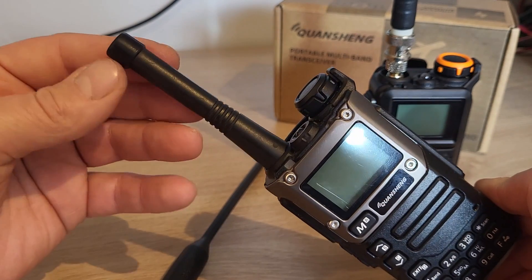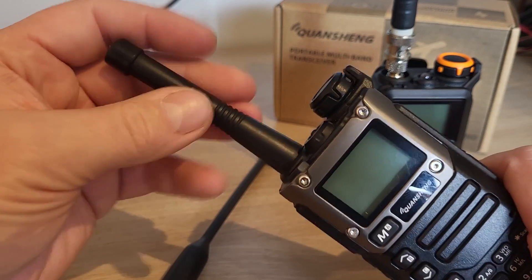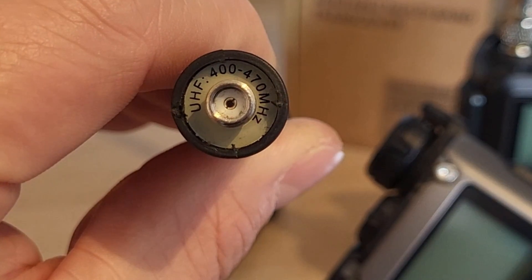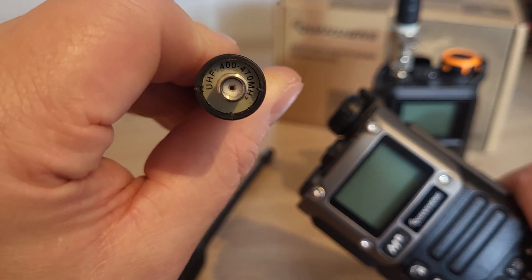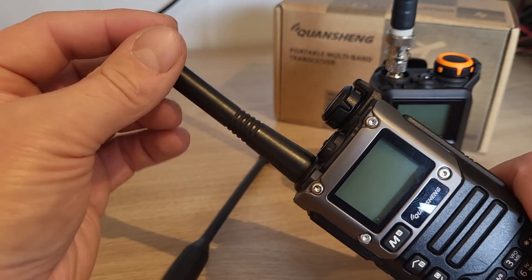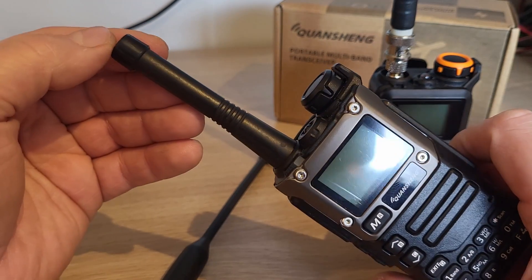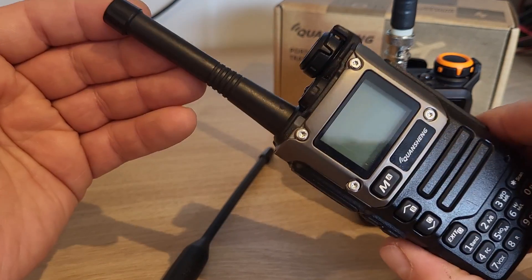You might be tempted to go for one of these little stubby antennas — they're okay on UHF, probably for local communications, but you're not going to get a huge amount of range. Just be aware that this particular one is only UHF; it won't do VHF — only 400 to 470 MHz as you can see. They're going to be limiting the range, but they're probably fine just for local 70cm working, or if you're using PMR446 in the UK or GMRS and FRS in the States, just for local comms.